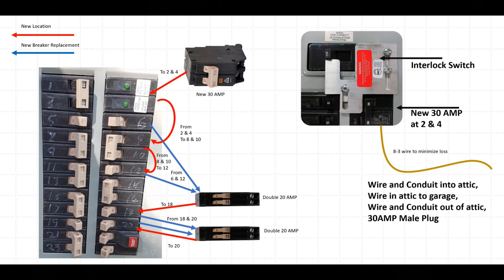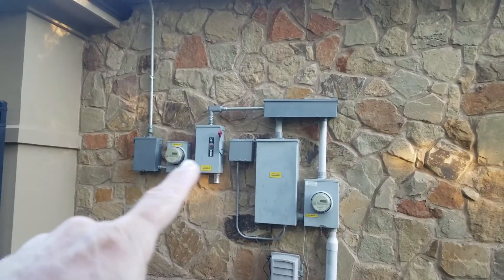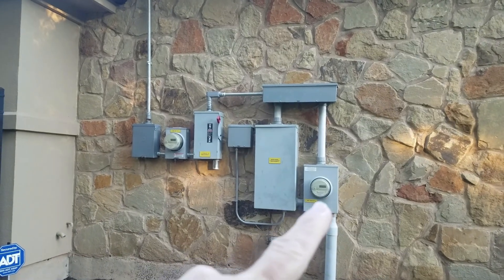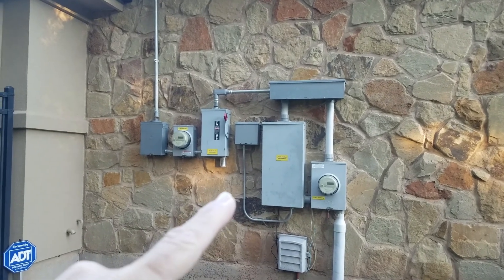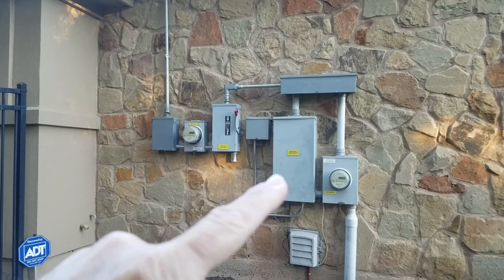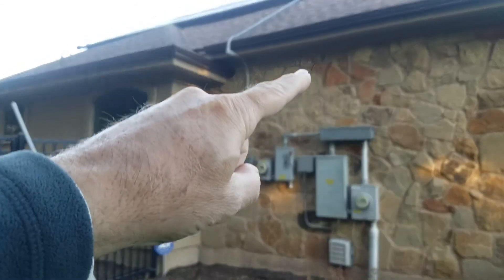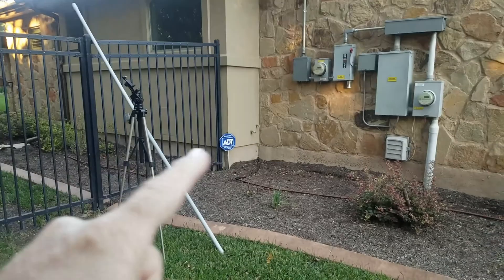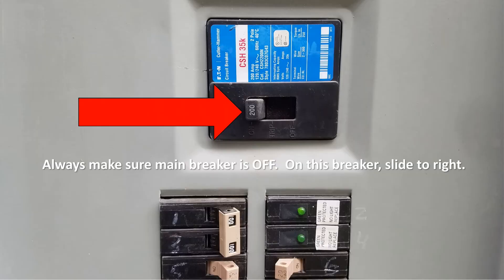I created a draft plan to move breakers, get an interlock switch, and add a Romex cable. Here are my breaker boxes — these three or four are for solar. They cut off when the city power cuts off. So I'm going to throw the breaker to the city power. What we want to build is an inlet box so I can connect my generator and power my house. The wire to the box will go up into the attic and across to the back so I don't have to run the generator next to the master bedrooms. Check and double check that you have the master breaker off.